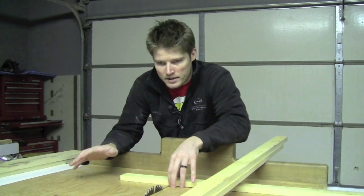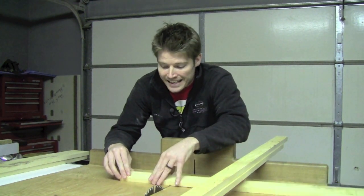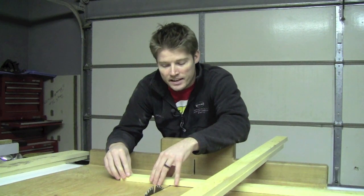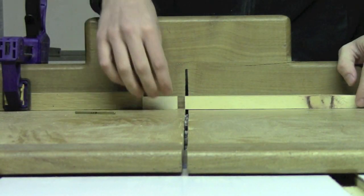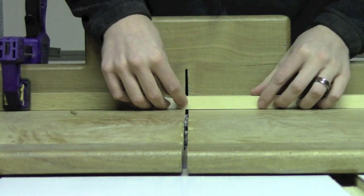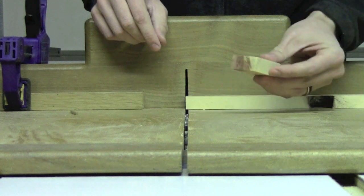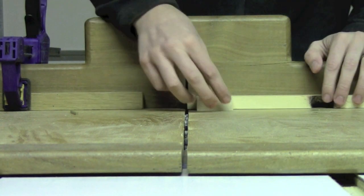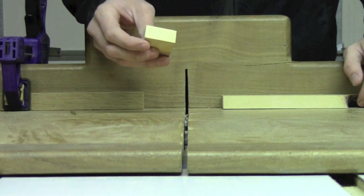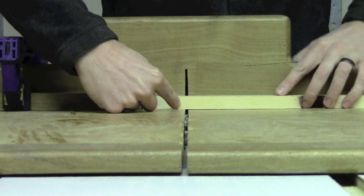My rails I left a little bit long so I could make sure I had enough. What I'm going to do is at the top and the middle where they join with the legs, I'm going to make a half lap, but I want there to be overhang because I'm going to put a chamfer on all the edges of that end grain. It's time to do the half laps. I have a piece of scrap here that I'm going to test this on - I'm going to make a half lap that is the exact width of the adjacent piece. So if this was the leg, it's going to intersect the rail and it's the same width as the rail itself. We're going to use a piece of scrap that's the same width as that rail as a guide spacer, making a cut right here which will leave the half-inch overhang I want on either side.